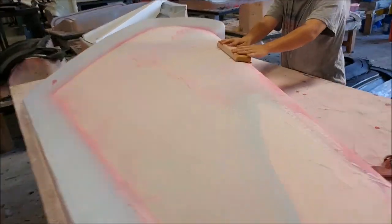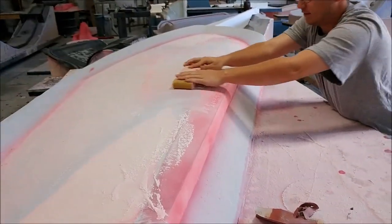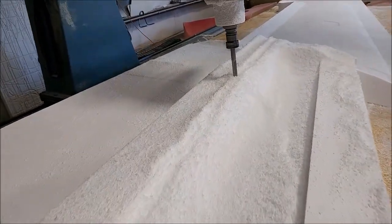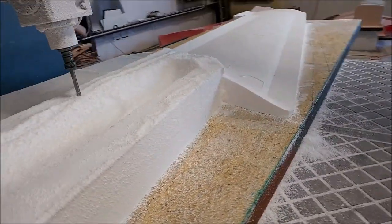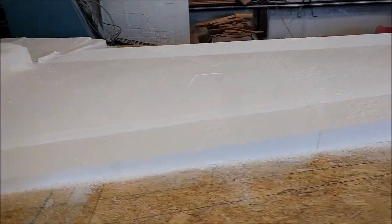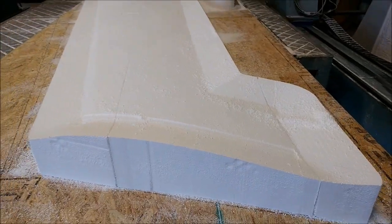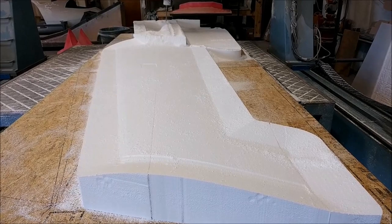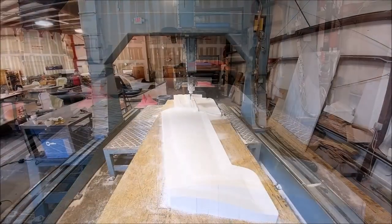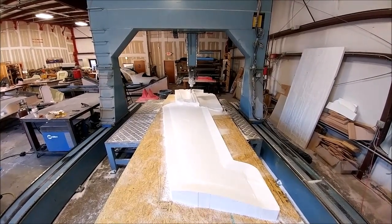Here's Zach sanding the right side upper strake skin — it's had one coat of primer already but will get another one. This is Friday morning, and as you can see, the first half of the wing plug has already been milled. It's been slid down and the second half is now being done. It came out nicely with the little indentations for where the access panels will be, and a six-inch flange all the way around. It's been cleaned up and is getting glassed today, Saturday. The machine is still working on the lower strake. That's the update for this week — thanks for watching.